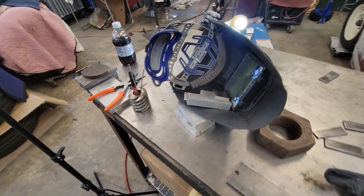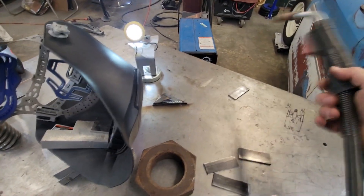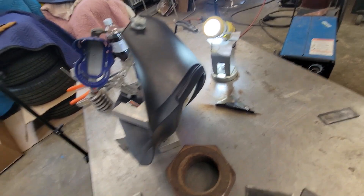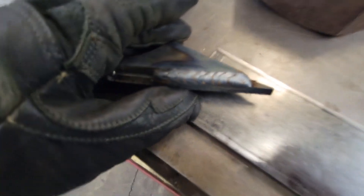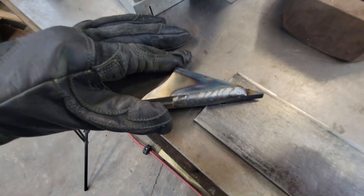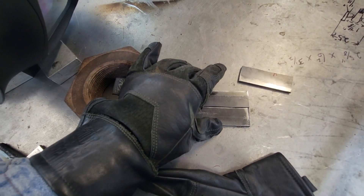I'm going to show you my little welding setup. I have my phone set inside my shield, and you can see how close it is — I'm having to weld around all this. It's not the best-looking weld, but it's not horrible either. Make sure you put yourself in odd positions when welding, because you're going to have to do it someday, especially if you're filming. It turned out pretty good. We're going to start off with just straight stringers on here.